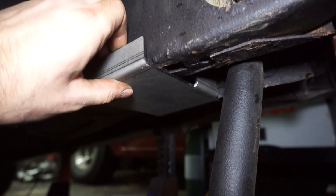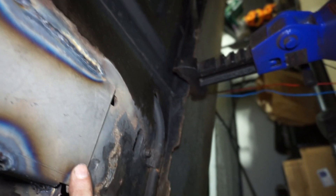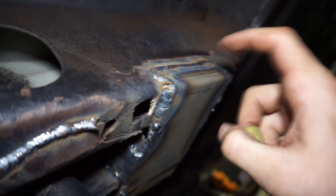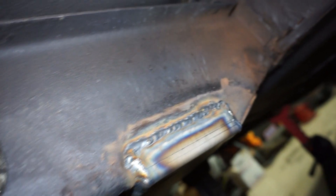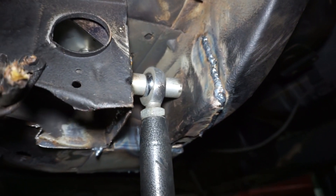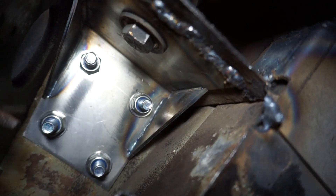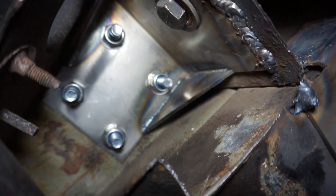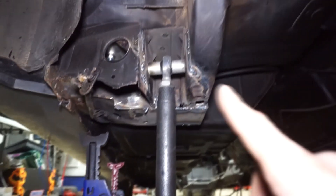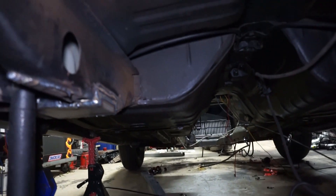Essentially this plate just goes up like this - I took a Sharpie, traced it out, used the brush to take all the paint off. I still need to weld the back side of it but we'll do that tomorrow. I did have to trim a little bit of the inside of the bracket to get this part to sit flush, but overall it welded on pretty decent - and by decent I mean it didn't burn through or do anything weird. I bolted the plate in tightly and then welded it, got the four bolts through up there. The wife actually helped me do that for a bit - she held the bolt in the right spot so I could get them tight from the bottom. Next video I'll be doing this over on the other side, then we'll get the subframe connector welded up and then we should be done with this project.